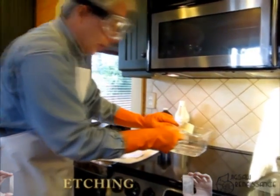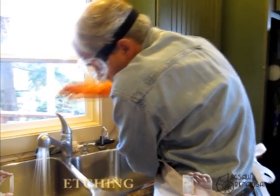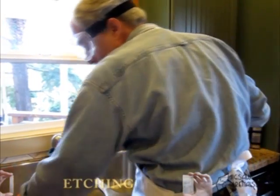I'm going to take it over here briefly just to rinse out. You want to make sure that the etchant and the things that make it — at least the hydrochloric acid — don't contact your nice stainless steel sink or anything else you don't want to etch. This stuff will etch pretty much any metal.